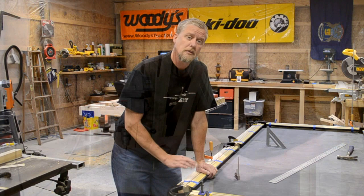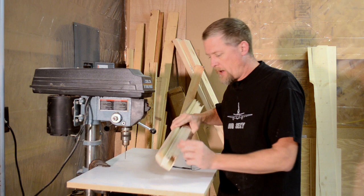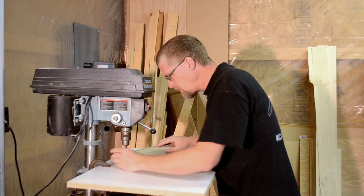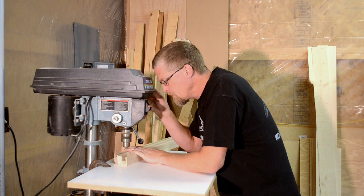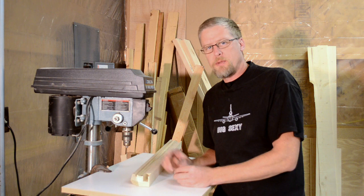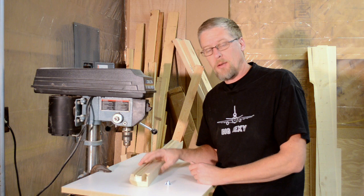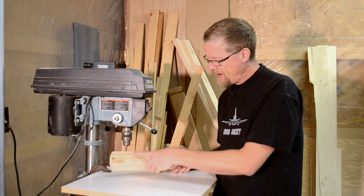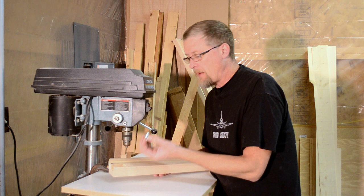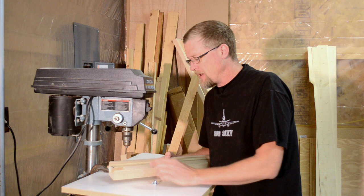Well, I've marked the location of my rail bolts and my pocket ears. I'm going to drill pilot holes through the whole stock on all of them. I'll do the pocket ears first. Well, ran into a bit of a problem. I had hoped to use blind nuts to attach my rail bolts, but as I'm drilling my pilot holes, something I didn't foresee is that my pilot holes end up right where my feather strip would be. This little eighth of an inch bead is going to show through in the final product, and the only way to do this is to recess it, and then rebuild this. This is going to be visible. I just don't think there's a good enough way to do this so that it will look proper.